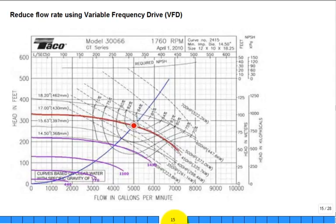And the pump manufacturers know that. So on their pump curves, they'll show you that this red line right here is at their nominal 1760 RPM running speed for the motor. But they'll also, in the software that they give you or that you can download, give you what the pump curve looks like when that motor is given a lower RPM. So when it's 1430 and 1100 and 770 and 440. And so now you can see that they're going to modulate the pump by controlling the motor.